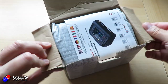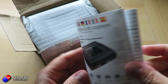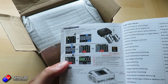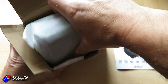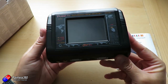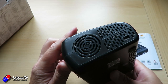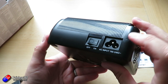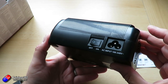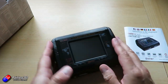DC input is — I think it says 10 to 18 volts on the website, although on the side it says 11 to 18 volts. 200 watts charge mode on AC power — 200 watts in total for both the two channels. DC mode is 200 watts on each channel, so 400 watts. Discharge power is 10 watts. Will support smart batteries. Charge current range is from 0.1 to 12 amps, assuming that the wattage will cope with that. Will support lithium ion, LiPo, LiFe, high voltage cells, and will also do balancing as well — up to 500 milliamps per cell to do that.